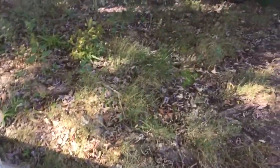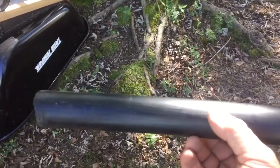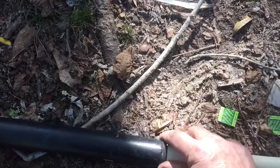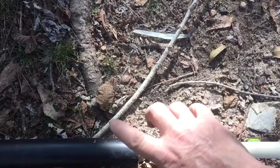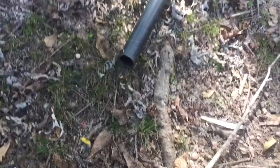Anyway, hey, we'll see you around. We'll do another video, of course, on the 2-inch casing, but on this, a foot valve sits on the end of this, or a check valve. You stick it down in the 2-inch casing, and then this fits in here, like so. So you picture this, 20-foot, 10-foot, whatever, and see how that goes in there? That goes in there, and that's what creates your suction. Because it's tight, but it's slidable, back and forth, back and forth. This is inside here. And so it's tight, and it's able to create suction. But we'll do another video on this pipe and the foot valve. We'll stick this back here. I've got another video that kind of explains that part of it. Check it out.